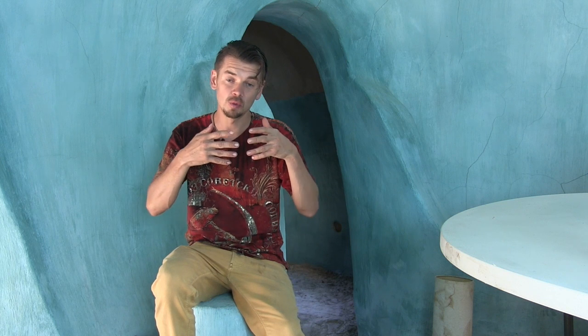And here is some of the creativity that we can experience. This is a buttress for sandbag dome. As I said, anytime you make a large opening, the dome has got its weakest point at the door, so it can flop out. Here you have to make either a tunnel, which you can connect to your aircrete home, or, in my case, I made a lovely couch that enters into our aircrete structure, and it will have a little fish pond there with a little water trickling.